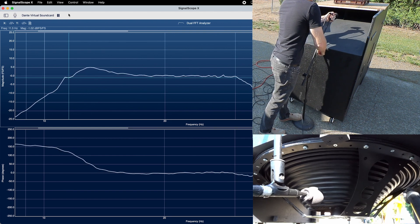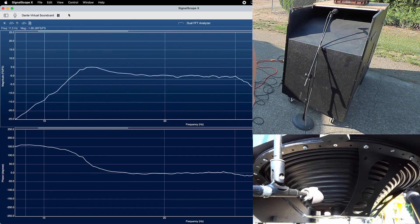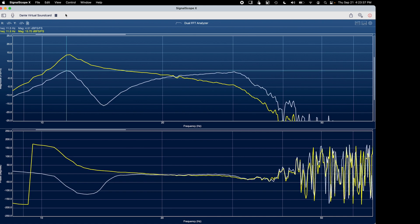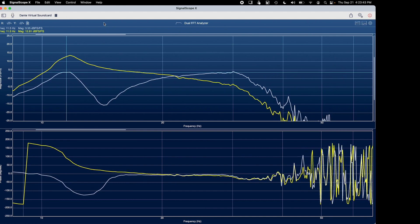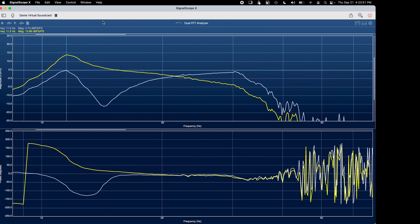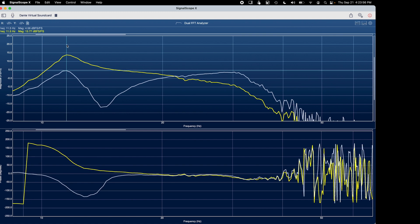Here's the thing — I'm not so much concerned with where the natural spike in the frequency response is, as much as I'm concerned with what frequencies the sub can reproduce with maximum SPL, considering power efficiency combined with excursion. The driver has a point at which there is minimal excursion but maximum SPL considering power consumption, below which the driver begins to excurse a lot and becomes power inefficient, for a brief exchange of peak SPL, but immediately followed by an extremely rapid drop in all categories when the phase relationship of the driver and port has already flipped to 180 degrees and they're cancelling each other out.